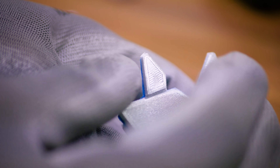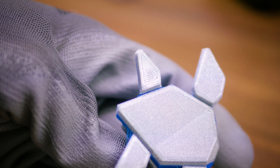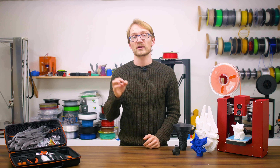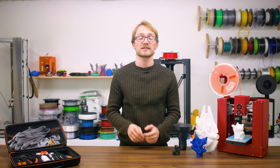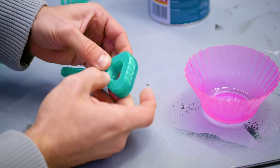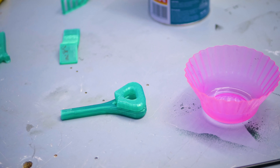For decorative purposes it's probably fine, but roughing up the surface with some medium grit sandpaper often helps as well. What you can also do for ABS and quite a few PLAs is solvent welding the parts with acetone, as shown here. That creates extremely strong bonds, and you can even get specific welding agents for PET if you want to.